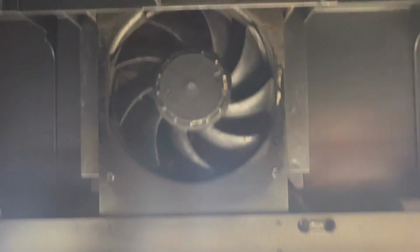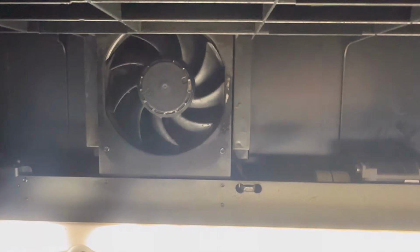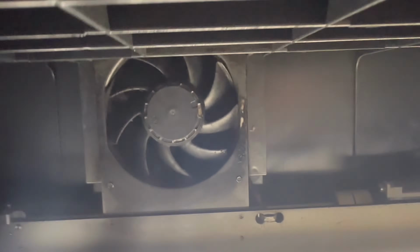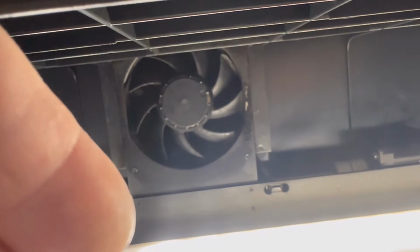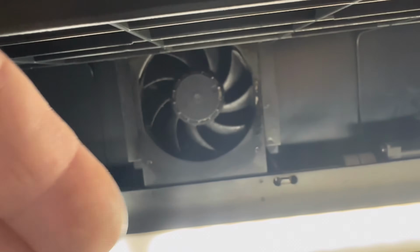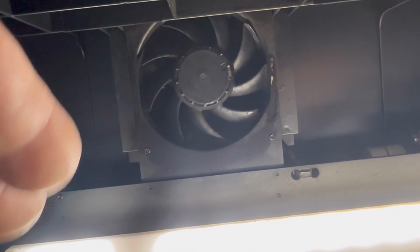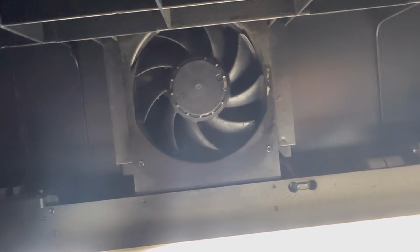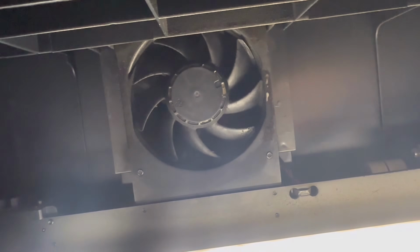So I've gone ahead and I took the wipe and I kind of spun it around and tried to wipe each fin off individually. I've gone through quite a bit of smoke, and I can feel the air come back through, and I knew that, especially where it's getting colder. So I'm going to get a damper on the end so that it stays closed. I should probably get almost like a dryer vent, but one that closes really well, and then the force will blow it open. If you don't have one of those, that should stop most of the cold air. And you can put a screen filter on the end of them.